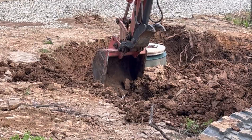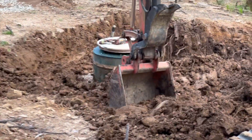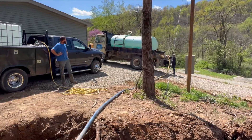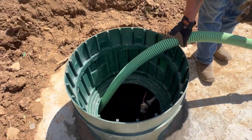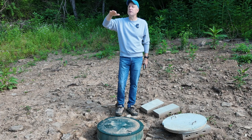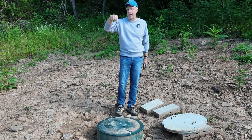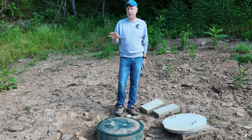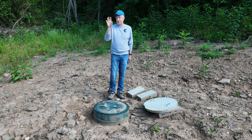It's been a couple months since we redug this whole water tank area, resealed everything, and buried it back in the ground. We got a water delivery and last time I was here I thought I was losing water — and I think I was — but I found inside that we had a little overflow in our toilet. The float was a little too high and water was leaching back into the toilet, a steady stream you couldn't hear. So I readjusted the float and turned off the pump before I left last time. It's been about three or four weeks since I was here last.